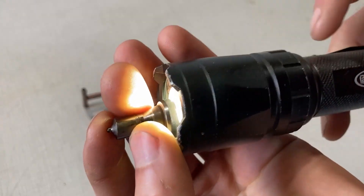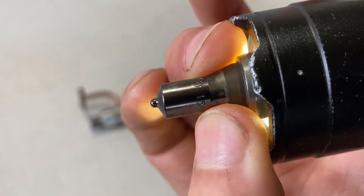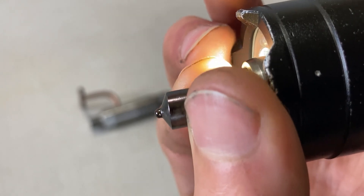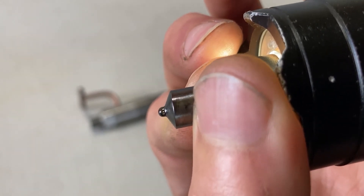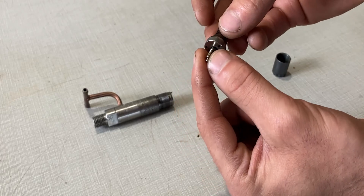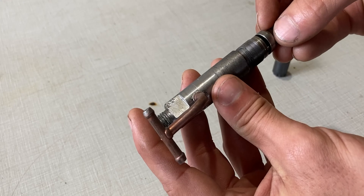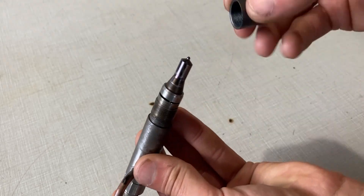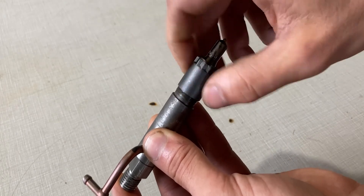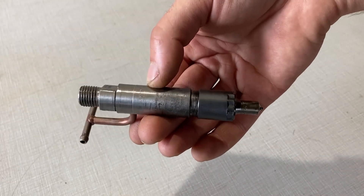I have a flashlight here and I'll share with you guys those tiny little holes on the tip — there's one right there and there's another one right there. There are a couple around the perimeter — there's one right there, and another one right there. So the fuel will be coming out of those tiny little holes on the tip of the valve body. Before you assemble all this you want to make sure this is lubricated, especially the tip of the valve nozzle. Once you put it in, you can align it with the two indexing pins just like that. Once it's held in place you can grab your retainer nut, slide that on, and tighten that all the way down — and then you'll have a complete mechanical diesel fuel injector.